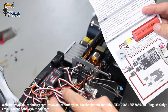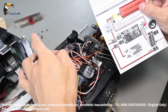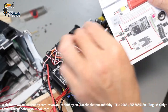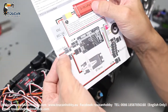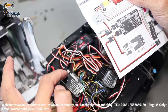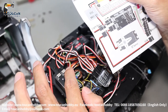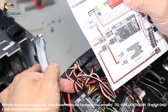But from the manual, we have other controls. Because this K3362 is not using all the functions — it is connected to the receiver and the light board and other functions controlled directly, not from the soundboard. So if you want to control from the soundboard, the light system connects to downside. This position downside: negative on the bottom, positive in the middle, and top is the signal wire. So the light system controls to here.